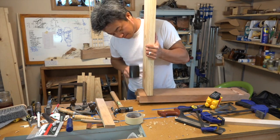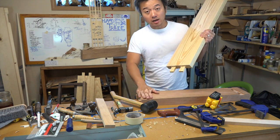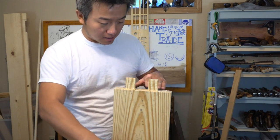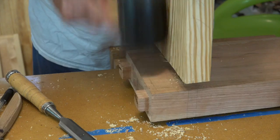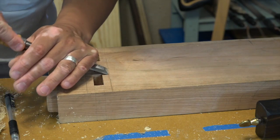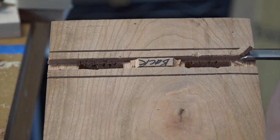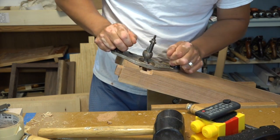What I need to do now is go ahead and clean up the shoulder here, make sure that it sits flush against the back of the tabletop. When I'm cutting this shoulder, I'm actually cutting it at a very slight inward angle — that way the shoulders will sit tightly. Making the shoulder portion is fairly straightforward: I'm going to lay out where I want the shoulder to be, create a trench or a knife wall, carefully saw out the two outer edges, then some relief cuts in the middle to help the chiseling process. I'll go ahead and use the router plane to get the bottom nice and flat, and it's pretty much finished.